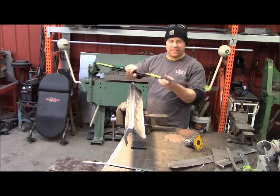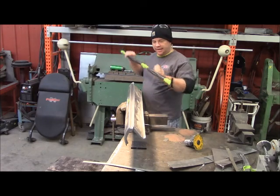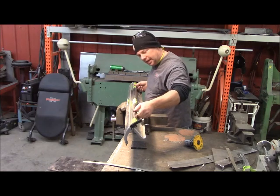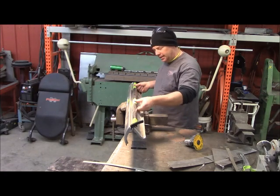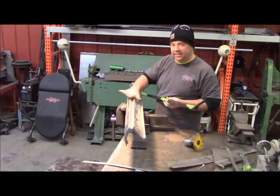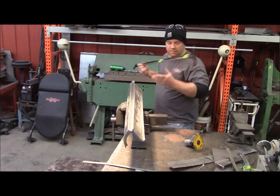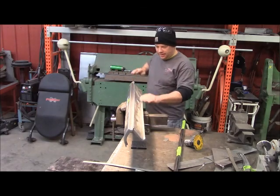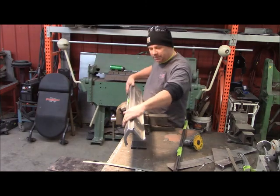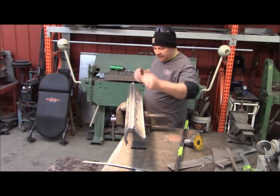I'm glad you really got those door seals because I'm using all this to mock these doors up. I got your bottom seal and the retainer strip from Tom, and got it where it fits right from the door, so I know exactly on the door where it needs to strike in relationship to the inner seal landing, which I'll use later on. Now that I know the numbers and how I'm going to get all this, I'm just going to locate this up on the door and locate this in the cab to where that door seal lands just like that — open the door, bam. So I'm going to pull off of that, cut this right down through here, shrink this edge to make it match the outside of the wood, and work this piece on into the side, then do the wood, then do the inner seal — because I can really put that inner seal landing just about anywhere I want.